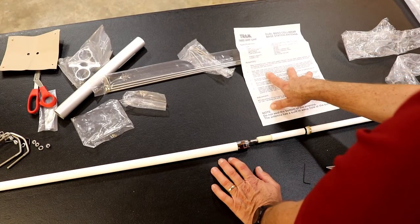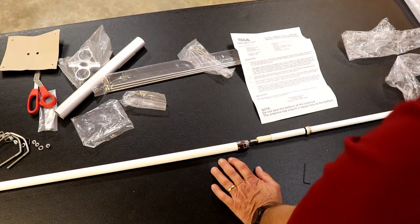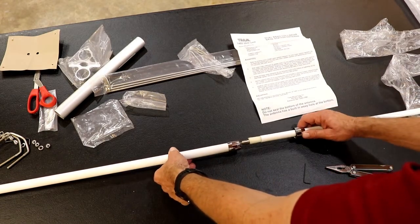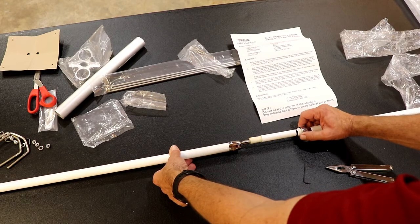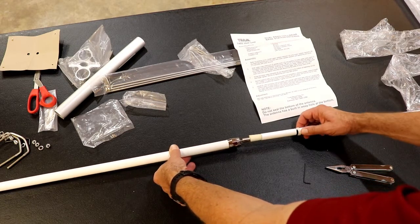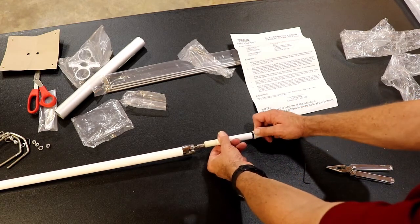Slide the upper outer shell gasket cover and gasket onto the upper outer shell. That's going to be this. Gasket must be positioned no more than 3 15/16 inches from the bottom, and I'm guessing that that's this black tape marker here.